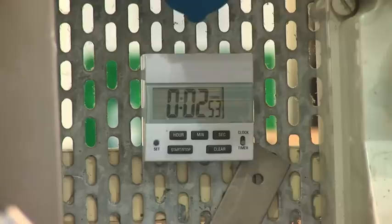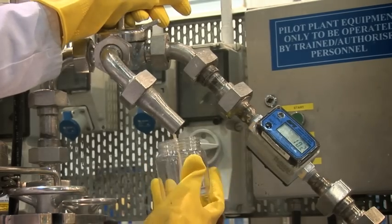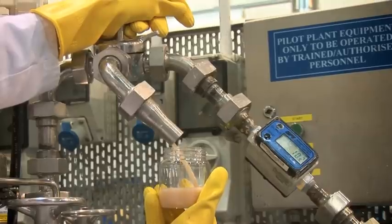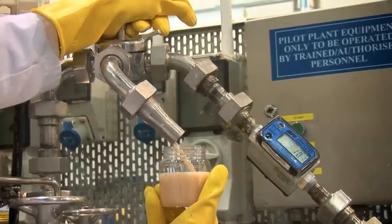When making a product, the mixing times are important. We need to make sure ingredients are properly blended before adding the next one. We start with the oils, then add the clays, and before we can add the active powder we want to make sure the clays and structurants are really mixed in with the oils before we draw the vacuum to take in the aluminium salts.